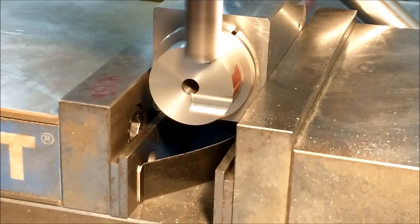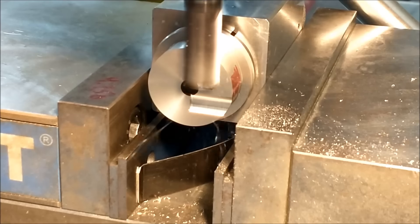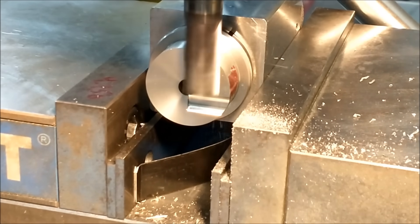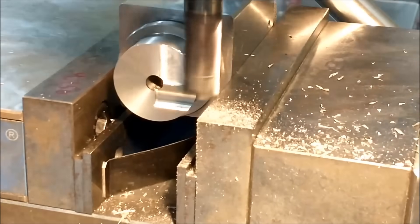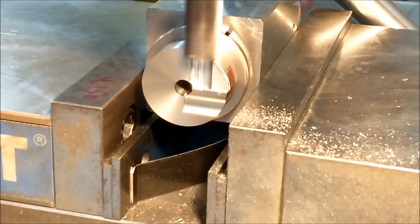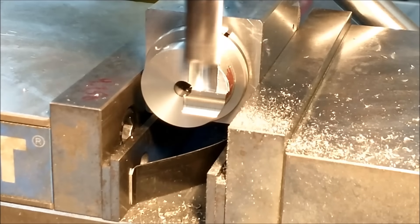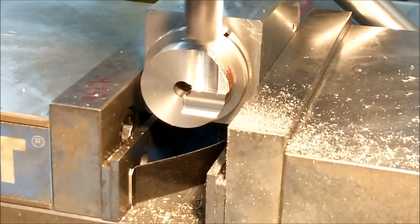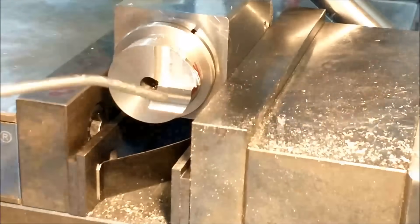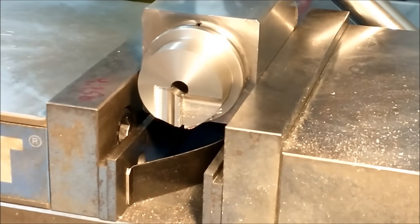The depth of the cut — the bottom of this end mill is forming the face of the driving tooth. You do not want the radius to interfere with that face. You can see the vertical line currently being formed by this cut. Make sure that vertical line stays away from the center of that through hole — it is a good visual indicator as to exactly where you are. This is a partial depth cut just for setting up my digital readout.